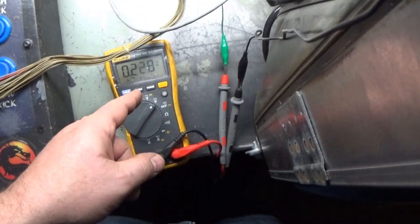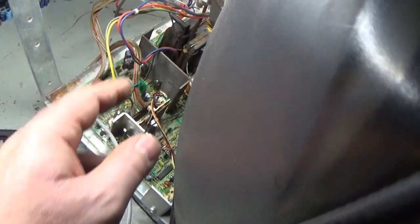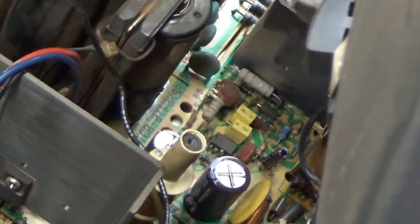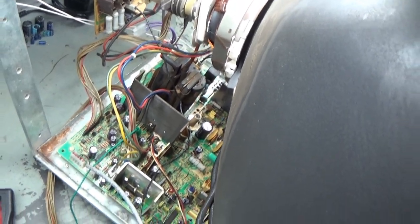We've got our multimeter set up here to read our B plus in case it's not around 117. I want to make sure that it is. And if it's not, I doubt that I'll be able to actually adjust it because it's covered in glue there. And focus up. There you go. It's covered in glue, and I'll have to replace it if it's not close to 117.